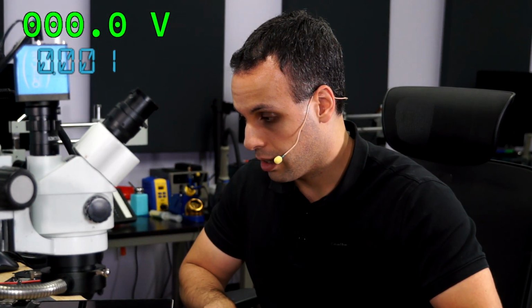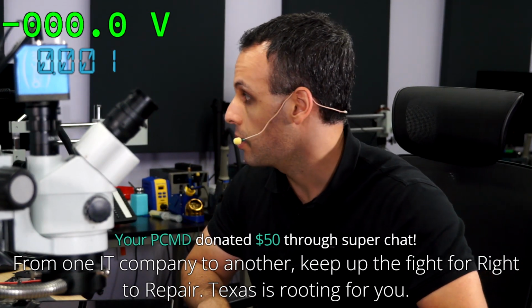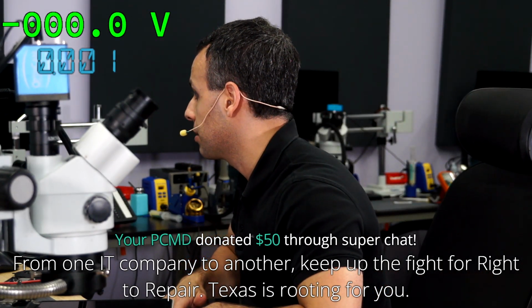Also, on newer machines, as opposed to older ones like the A1278, on A1502s, A1398s, these typically boot up now with a black background, not a gray background. So it's a bit different there. But this machine was getting 3 volts to the screen instead of 5. And once we removed the inductor, we were able to isolate the short to being before the inductor, not after it.